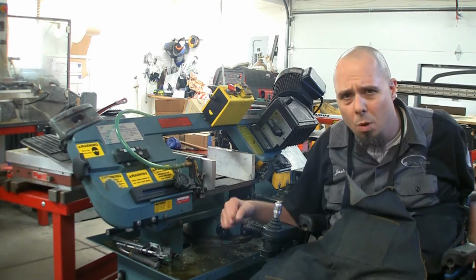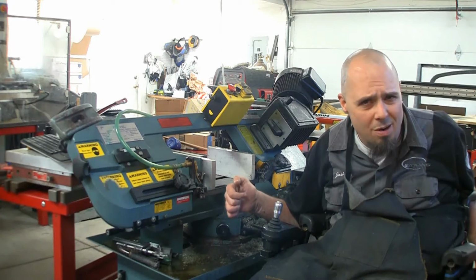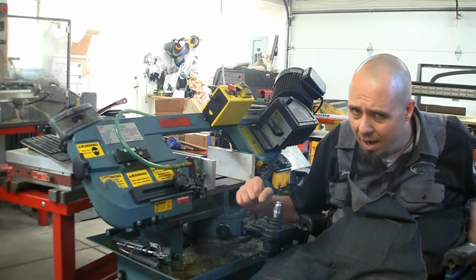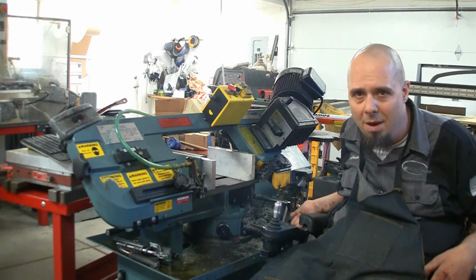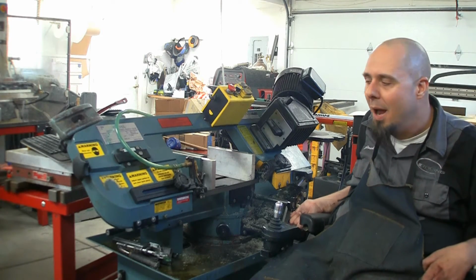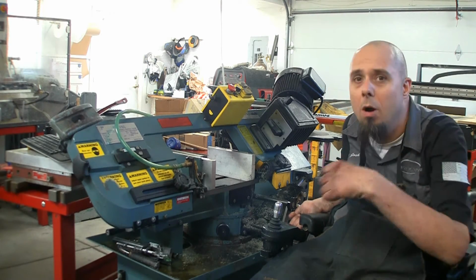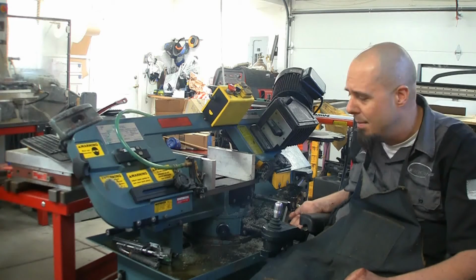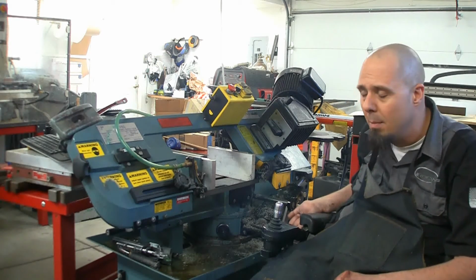But anyway, it's a water soluble oil. So you mix it, I think it was 5 parts water to 1 part of that. I could be wrong. It was just called Slugger. I remember that now, it's called Slugger. But anyway, the coolant's nice, especially when you're cutting part after part after part. The blade starts to heat up, and especially the aluminum really starts to gum up.